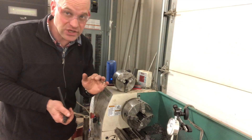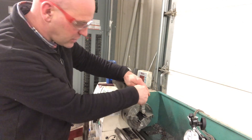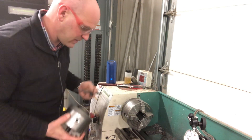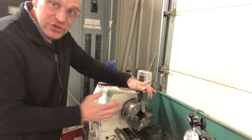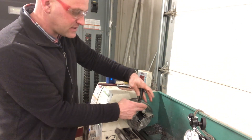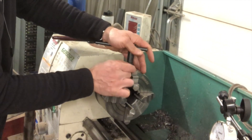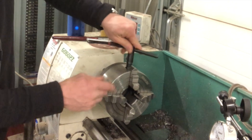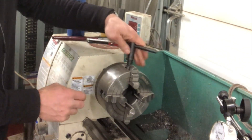With a four-jaw chuck it's not that way. When I go to turn with my chuck key, only one jaw is going to move at a time, so it makes it a little more difficult to clamp down on things. When I actually got this, the jaws were faced the opposite way — the narrow part, the one that has less to grab on, was on the inside. It's really easy to change those out: all you have to do is back them all the way out, flip it around, and then put it back in. Pretty easy to do that.